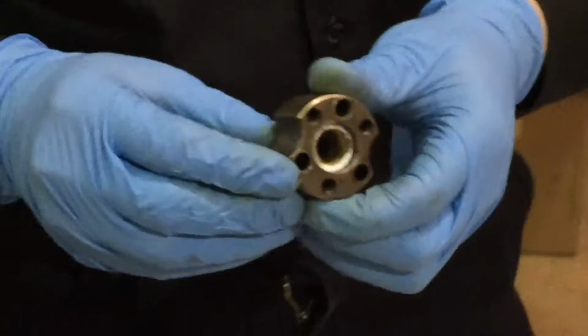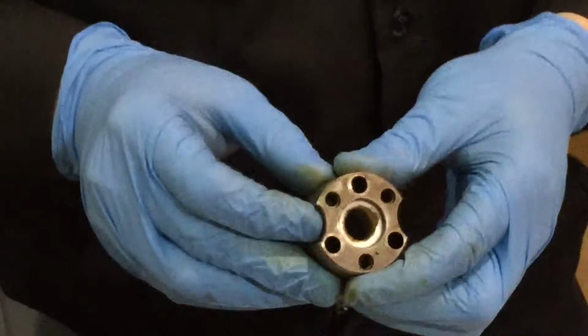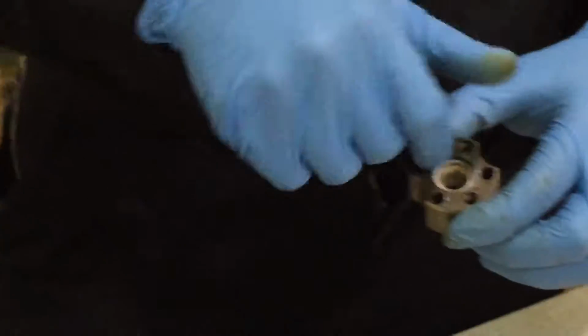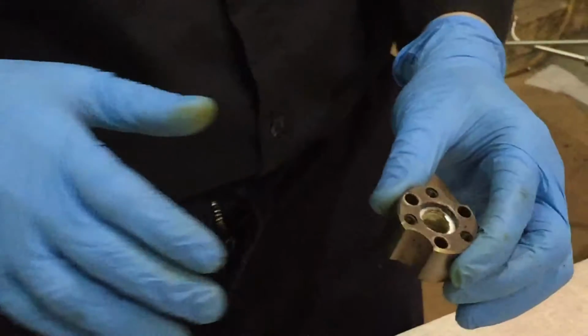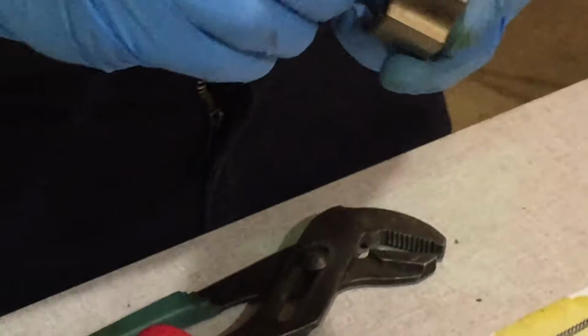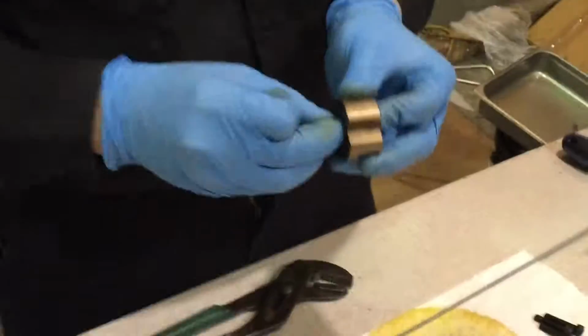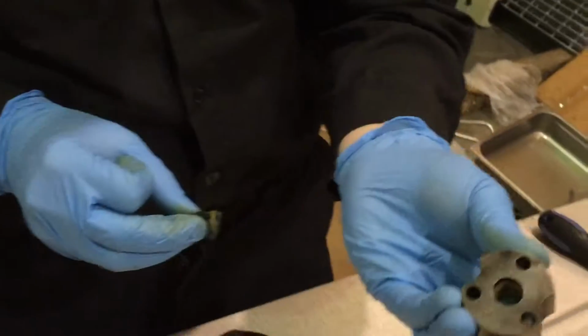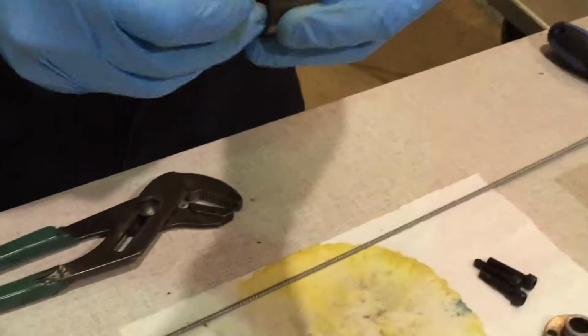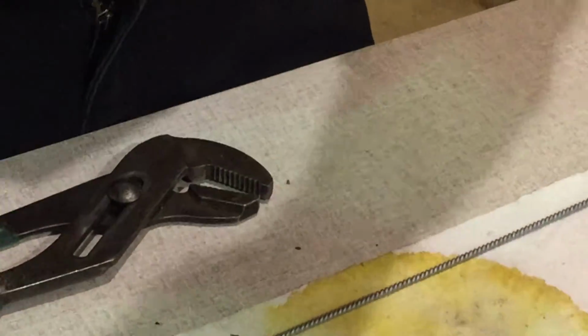Next is our packing piece. This you do not hit with acetone. I repeat, you do not hit this with acetone. You will eat away the packing and you will vacuum leak badly. What we do with this is we take our small piece of Scotch-Brite, just clean the metal part of the hole, as you can see there. Just clean it a little bit.